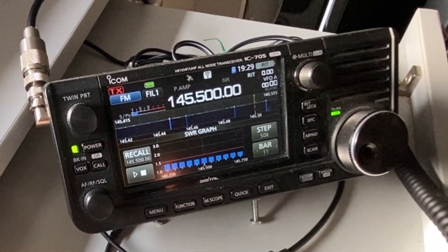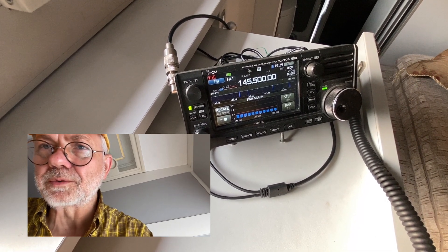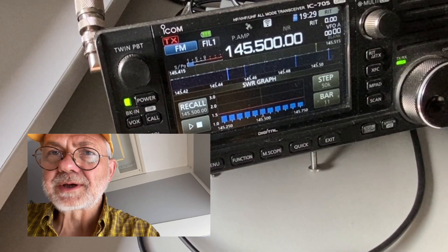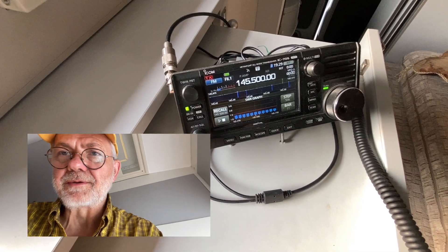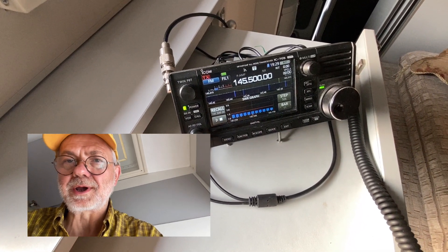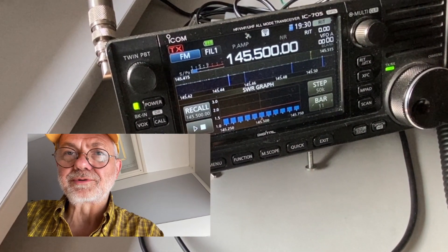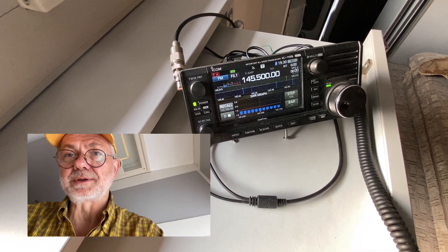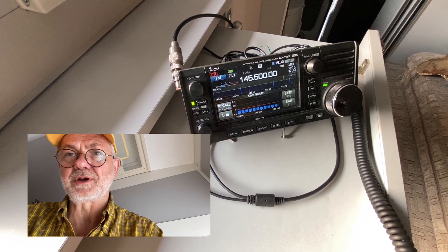In the range from 145.250 to 145.750 MHz, the SWR is less than 1.5. The best SWR is on the top end of the 2-meter band in the FM range — less than 1.5, no problems. My cable is not the best in the world; it's RG58, not probably the best cable for VHF/UHF.